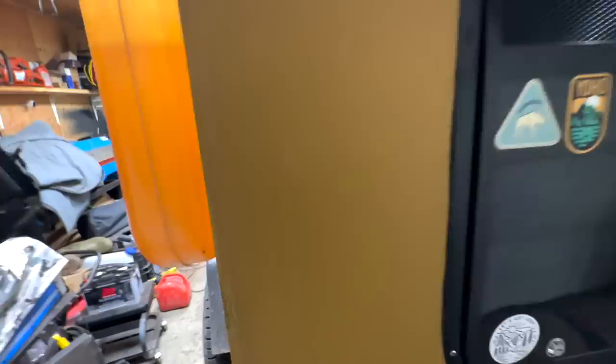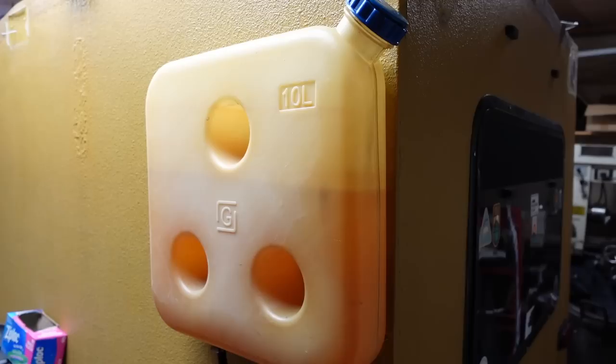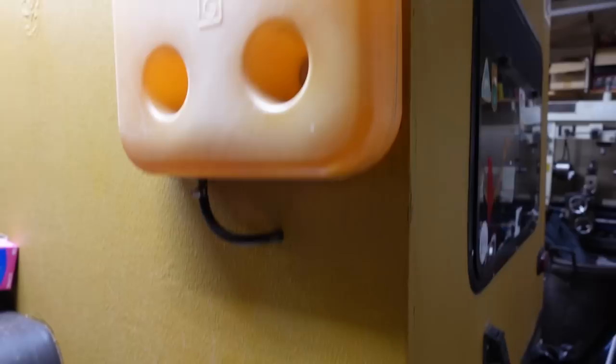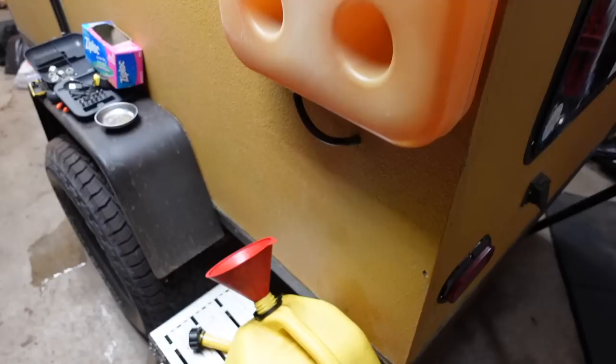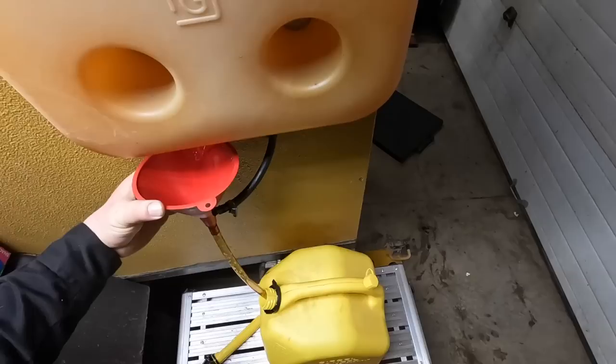That cover's off for painting. There's the sign in the corner — still got the diesel tank. Everything's cleared off and I'm putting it all into a labeled bag. I need to get rid of this diesel tank: it doesn't appear to be UV rated — you can tell it's already yellowed and the cap is cracked. I don't like the setup with the rubber going through the wall. I've got a stainless steel tank coming in and a bulkhead fitting to clean that up. The fun part is draining all that diesel out into my jerry can.